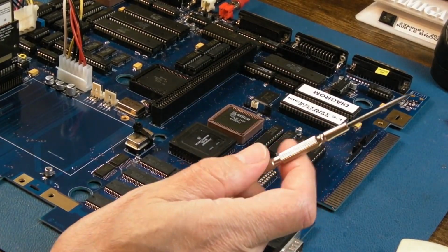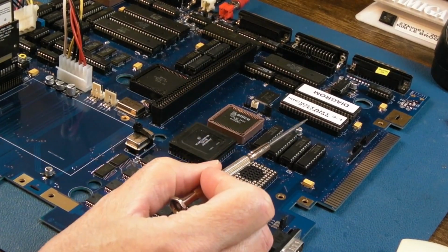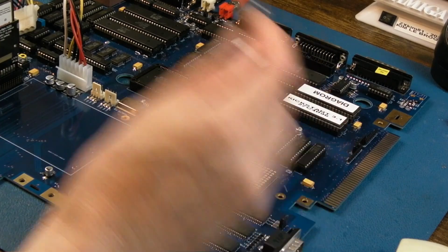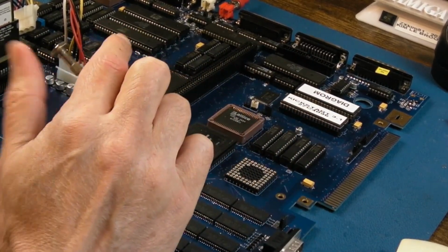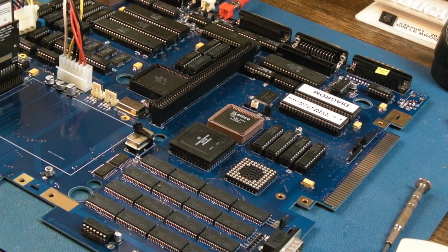There's an issue, though, that the hard disk access is really slow, and you've got to change the mask for the drives. What I'm not sure about is if I change that, am I going to be able to use that compact flash card back in 24-bit DMA again? Or is it going to, in 24-bit Zorro 2 range, or is there going to be an issue? So yeah, at this stage, I'm kind of reluctant to do it.